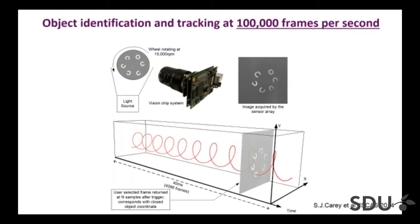We tried to push it as far as we could. The fewer points you return, the more you compress the data on the sensor and the faster you can go. We implemented a system extracting just one point of interest from the entire image — the location of a closed object as opposed to an open object. We're spinning a wheel on the end of a Dremel drill and extracting the coordinate of its center. We were able to demonstrate doing that at a hundred thousand frames per second: capturing the image, finding a circle, finding its center, and sending out the coordinates.